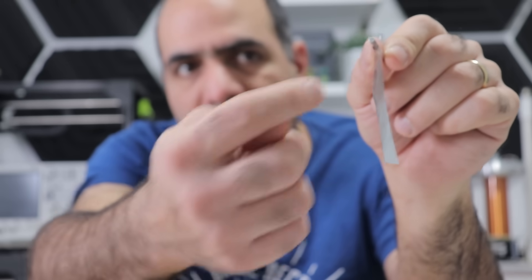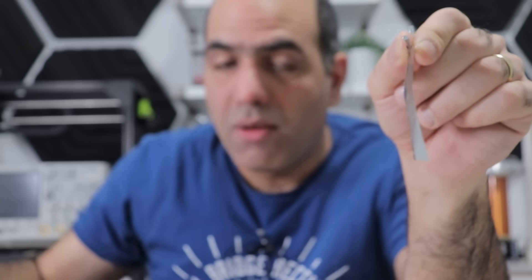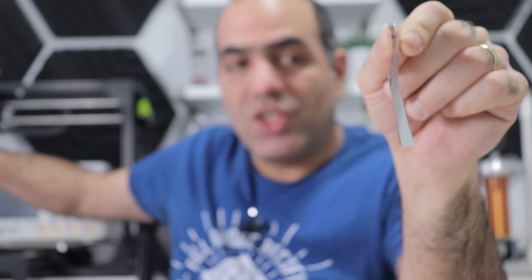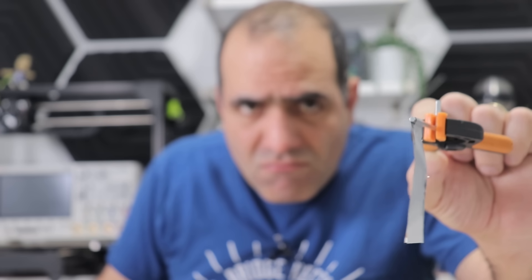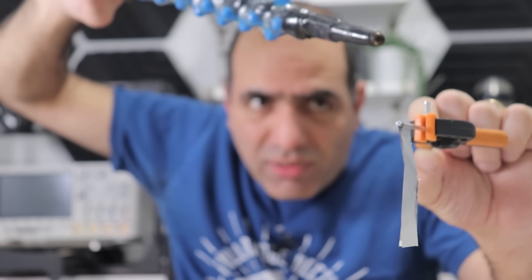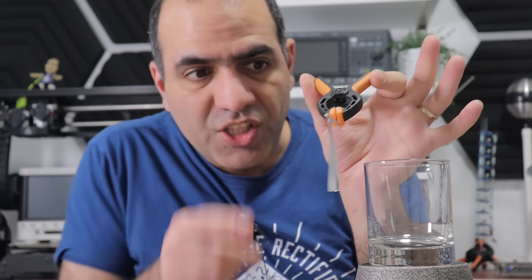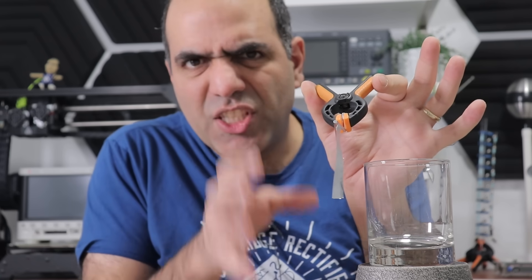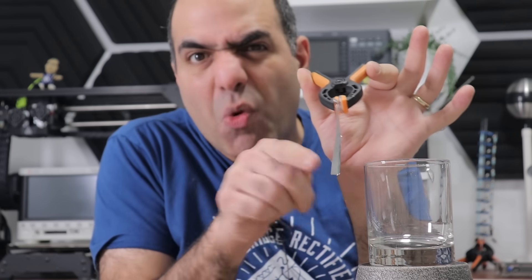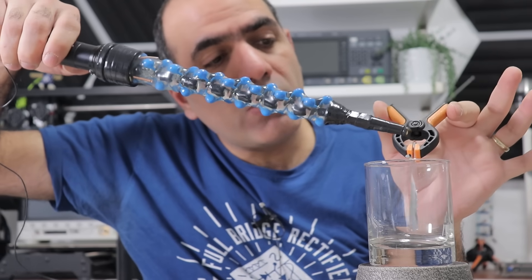For example, here I folded a thin sheet of aluminum foil. And if I use my magic wand that creates electrostatic charge and charge my body, you'll see that the sheets will spread apart. OUCH! Needless to say, charging your body will have consequences. So let's just charge those plates. They open out a little bit. Of course these sheets spread apart because there is the same charge on them that repel each other. But these can't hold charge for long because the charges run away from sharp edges, and that's why they typically put them in glass jars to hold the charge.